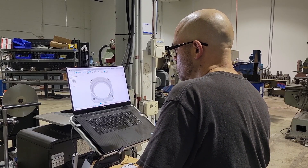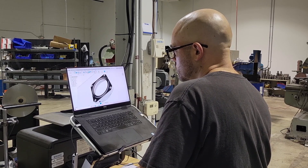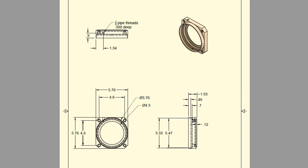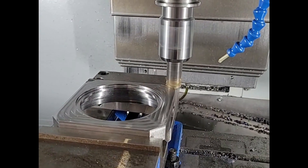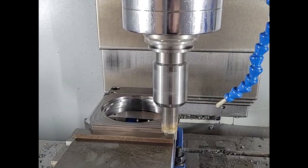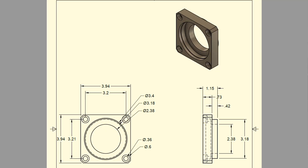In this segment I'm going to show you some prints, show you the parts, flip through some CAD files, and explain what the parts are that we're making. The one you're looking at here is a grout site cover — this is for a box spindle. This cover gets torn up and does not last the teardown process or being in the machine. So it's a regular basis that we have to remanufacture these covers. Here you see the mill milling the backside of the cover after it was flipped around. And here's a smaller grout site cover — same as the larger one, it gets torn up.